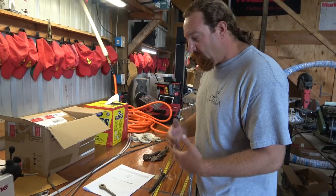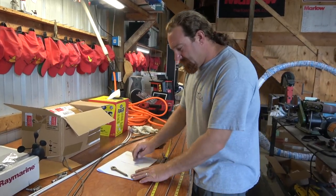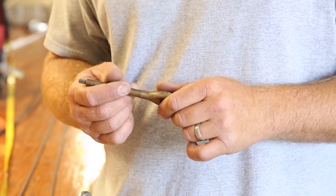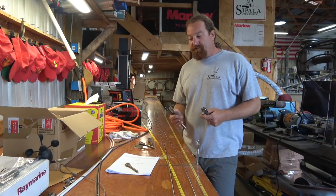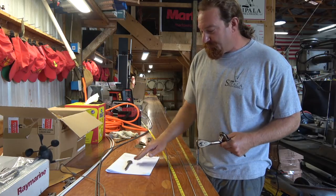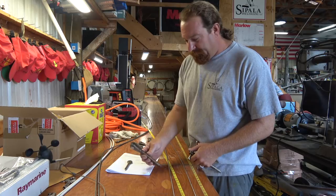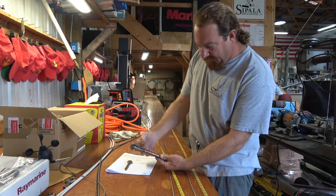The next thing that we look for is just any undue corrosion. The tarnish that we had said, this is a relatively corroded fitting. And this fitting has a crack right there. So there are, in general, two types of cracks that we'll see in fittings. We'll see a longitudinal crack, or a crack that's running in line with the fitting, and then we'll see a circumferential crack as well, which is a crack that's running around the radius.